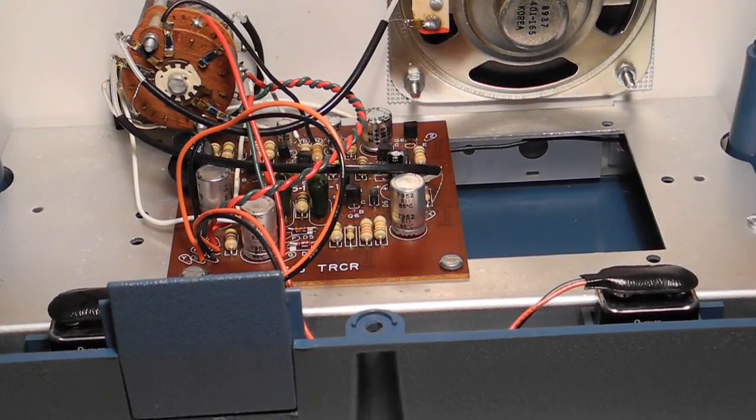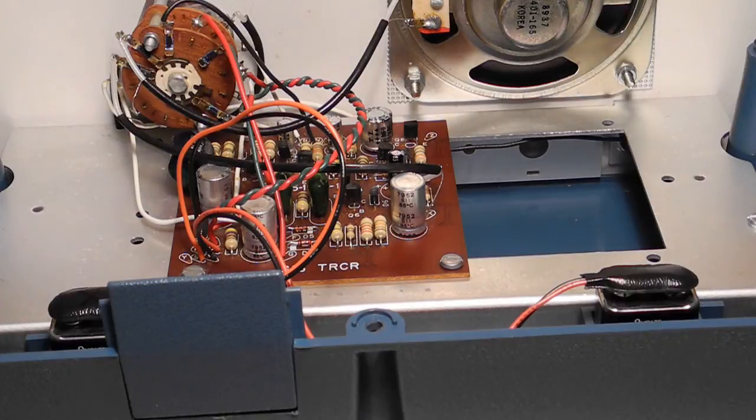Getting back to the original three resistors that were the wrong value, I have to wonder if the unit ever worked. I suspect even with the wrong values it would still have worked, although possibly with reduced gain. The bad capacitor was an electrolytic cap, and these tend to fail after a few decades, so it would have almost certainly only failed years after the kit was built. It's somewhat ironic that I diagnosed the unit using the signal tracing technique, exactly what the unit is used for.